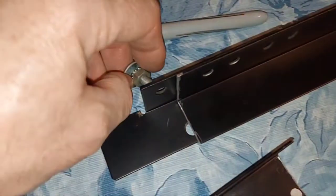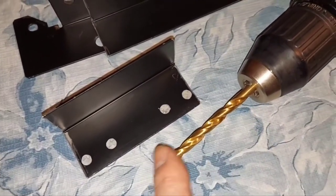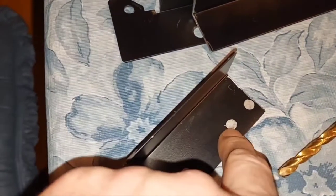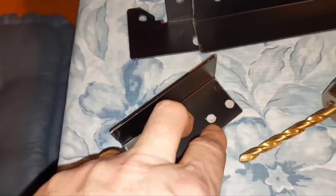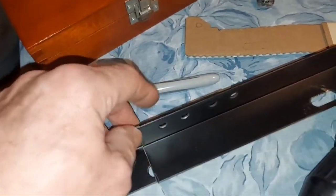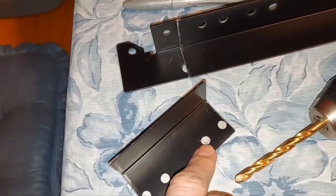These fit into the screw holes with just a tiny bit of play — just a very slight wobble. That is the exact width as the shaft of this drill bit, so it'll make a hole that's just perfect for that screw. If I need to, I can wallow it out just enough to match these holes, because once I run the drill bit in, it's going to be slightly smaller than the diameter I've marked since these holes are just slightly more than quarter inch. But I want to clean the rough edges up anyway with a Dremel bit, and if all these line up perfectly with the bracket nice and tight, there's really no reason to widen them — I can just clean the burrs off.